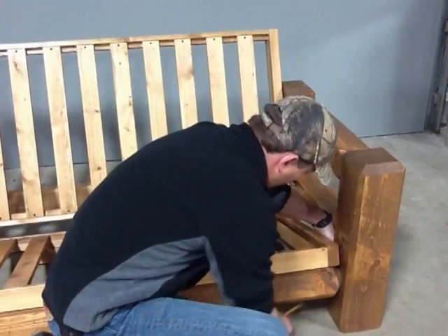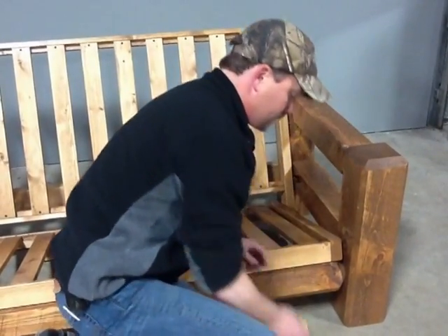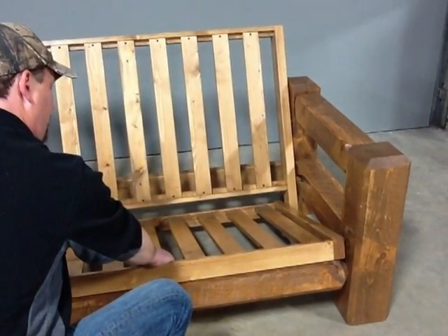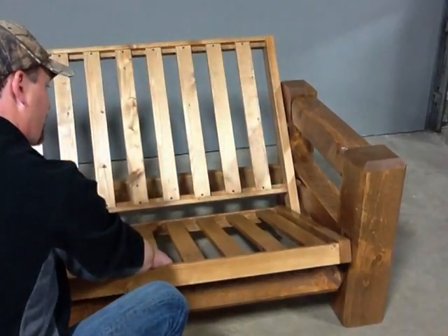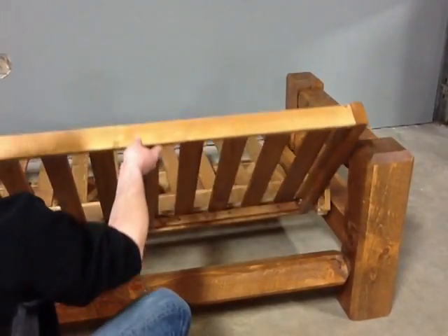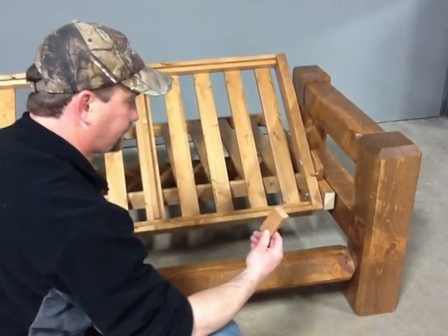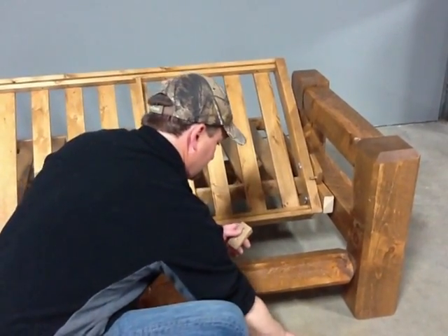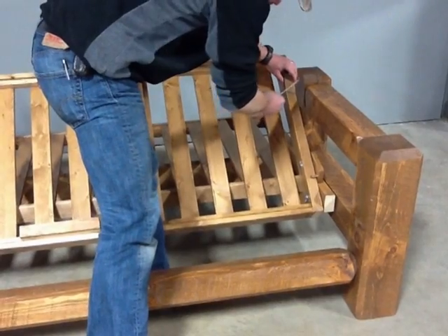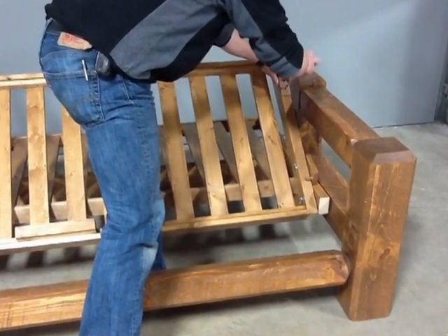While holding the wood stop in this position, take a pencil and draw a line across the small end of the stop on the seat section end. Do this on both ends of the seat section. You will now need to put the futon frame in the bed position. Standing in front and center of the frame, using both hands, lift up a little — maybe two or three inches — and pull in horizontally straight towards you until the back and seat section are flat down in the bed position. Now lift the seat section up vertically and over center until it rests against the back section. You now have the bottom of the seat section showing so you can mount the wood stops. Take a wood stop and hold it in the same position you had it when marking it with a pencil, then move it down about a quarter inch covering the pencil line and secure it to the seat section using two of the screws and a screwdriver. Do this again on the other end of the seat section.